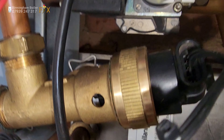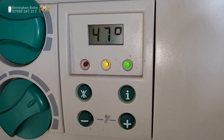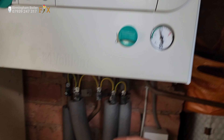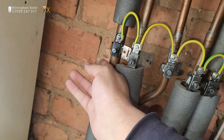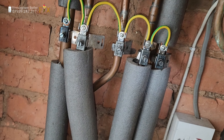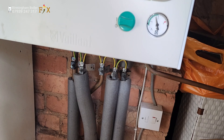It's moving around nicely and that's sorted now. The burner's on and the central heating is on — we've got the central heating demand on and the pipe on that is warming up. Thumbs up, we've got this one sorted. All it was is a spindle out of the diverter valve.